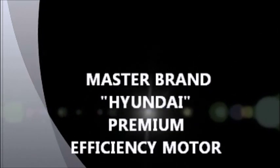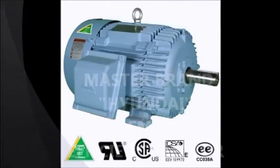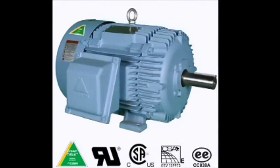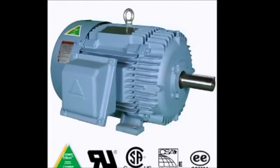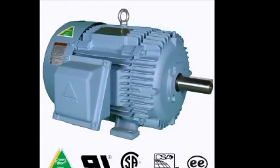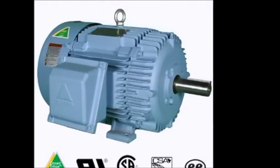The Hyundai motor supplies the muscle for the rotary screw compressor. The motor operates at 1750 RPMs with four poles, starting torque and low harmonic distortion, which reduces motor noise. Premium motor bearings produce a 60,000 hour motor life. Flexible voltage range of 208, 230, 380, 460, and special order 575.